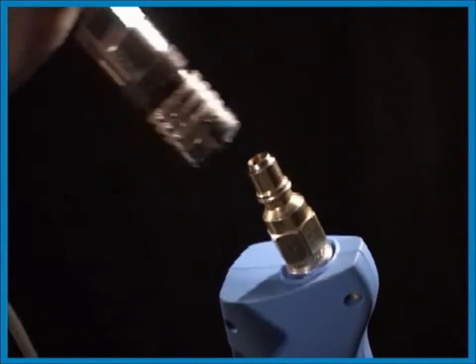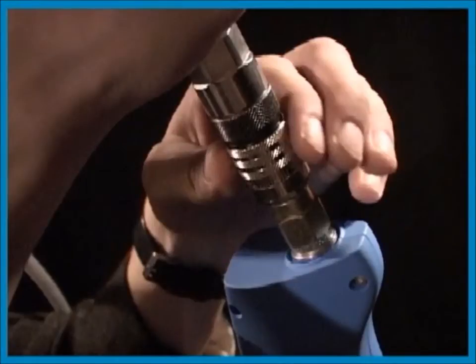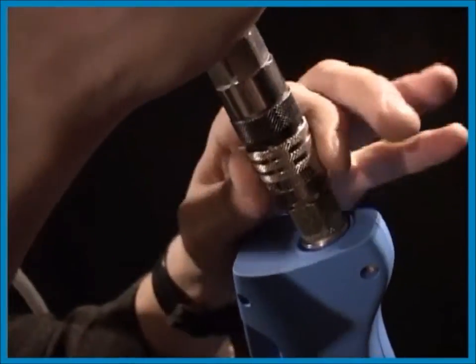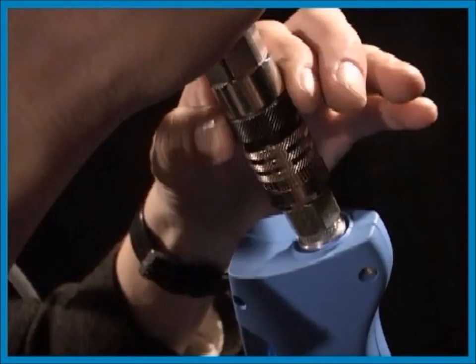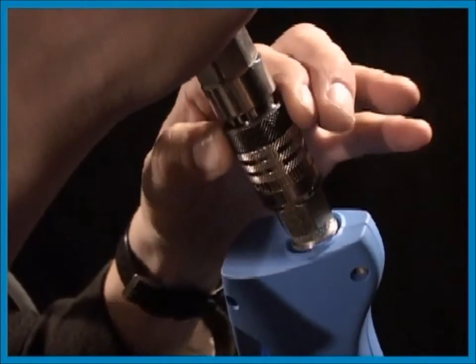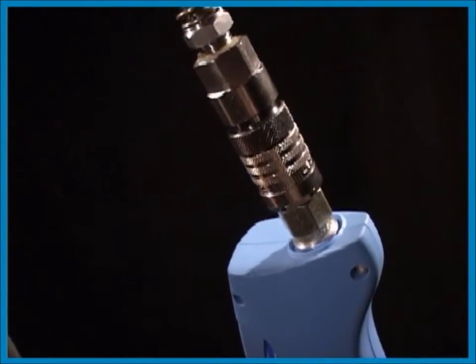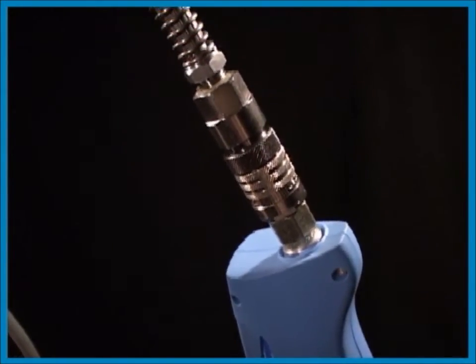Use the enclosed tool and tighten smoothly. To attach the gun to the hose you'll first have to pull the rear section of the coupling backwards and then press it onto the hose. Secure the coupling by pressing the black ring forward and then turn it. The gun should not be detached when there is pressure in the hose.